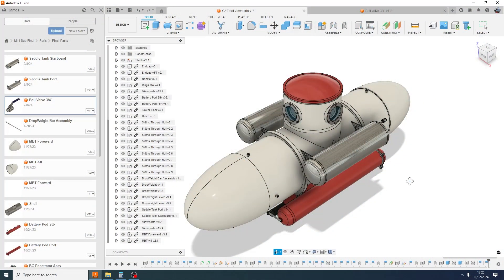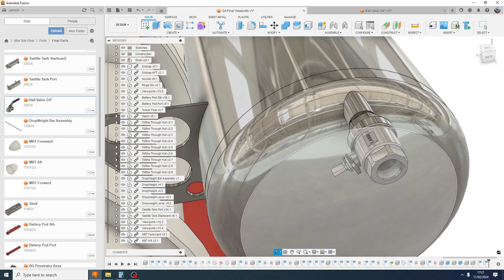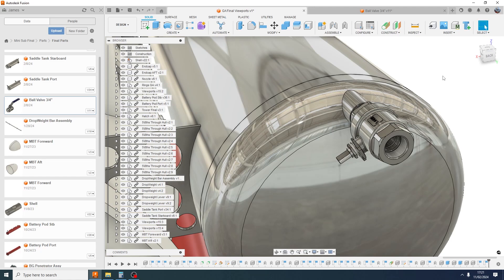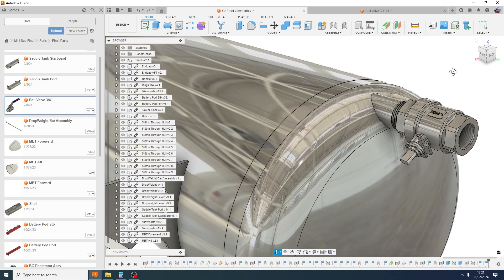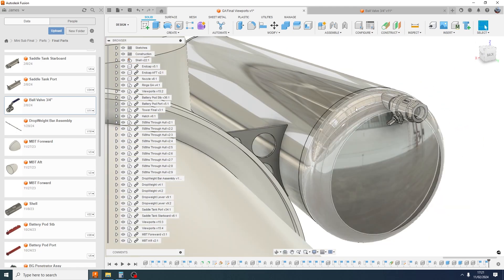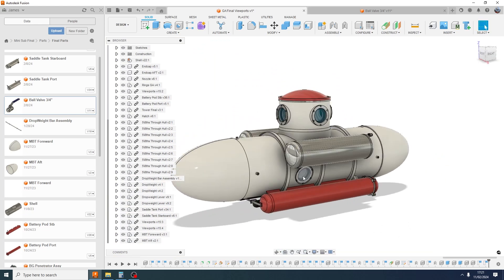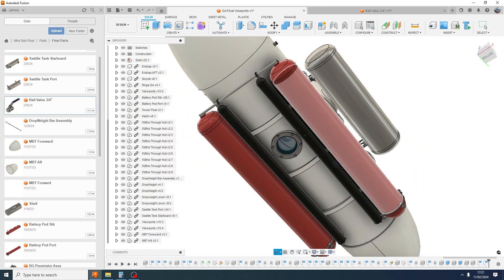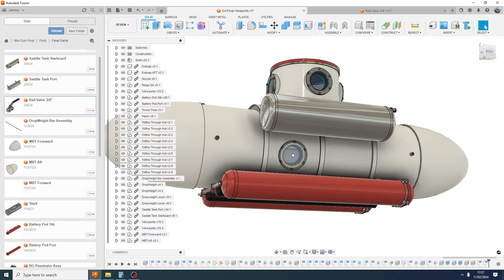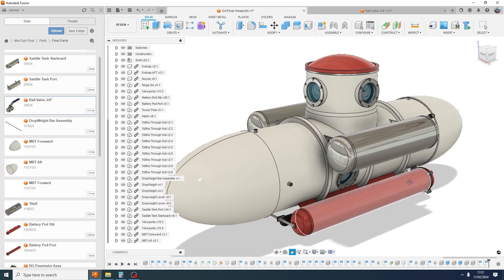I just quickly measured the angle on these valves. I actually had to model the valve because I didn't have the exact one on McMaster-Carr, so I messed around for ages modeling those. Anyway, the angle was 30 degrees from the horizontal. The other thing I wanted to show was the viewports — I'm thinking of putting two extra ones in there and there. I've got the one underneath which I think will be quite good, but I'm tempted to put another couple in and I just need to do some analysis on that to see if it's going to be OK.